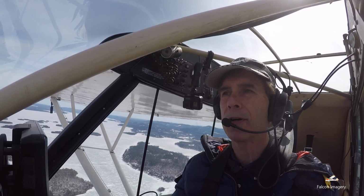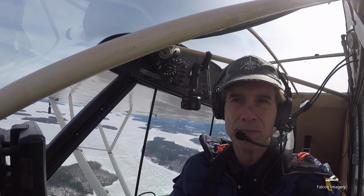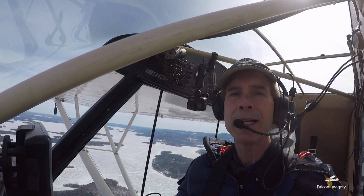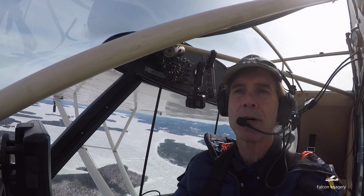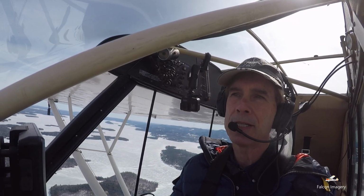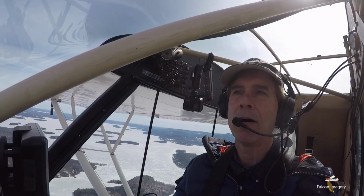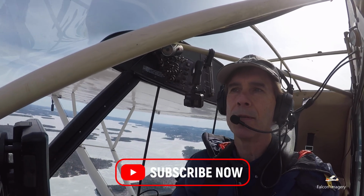Typically with Piper aircraft, Piper Archers, Piper Warriors, Super Cubs, not really using carb heat very often. Frankly, I've never used it in Piper Archers or Warriors. Never needed it. Always test it, always use it to make sure it's working, but never had a carb icing situation. Again, I think it's something different with the ductwork on the air intake on the Piper aircraft versus, let's say, the Skyhawks.